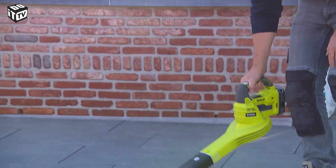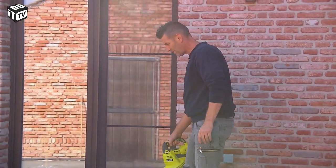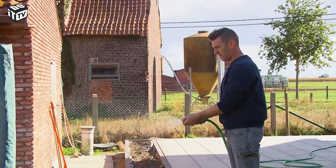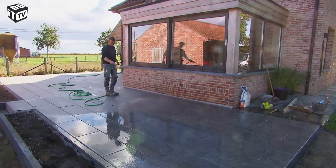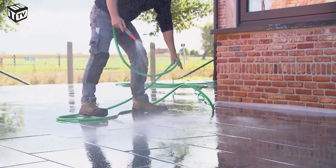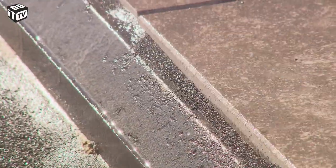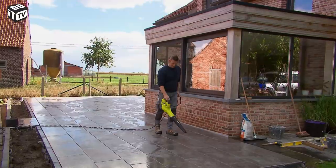Eliminate remaining sand grains from the patio — a leaf blower can be used, particularly effective with tiles that have significant relief. The polymer sand is clearly in its place. To securely bind it together, you need water. Use a garden hose and moisten your patio, working in large areas and providing each part with sufficient water. Once your terrace is completely wet, go over it again so the sand in your joint is completely wet to the bottom. Any stray sand grains are immediately washed away, as they should not stick to your tile, flower box, or stairs. Then remove excess water with a squeegee — a leaf blower aids here too.